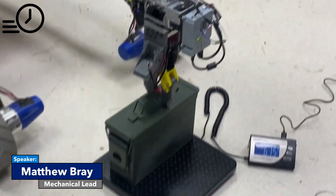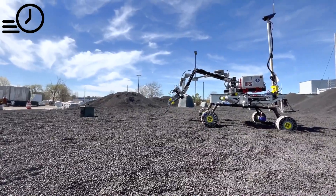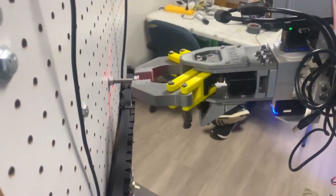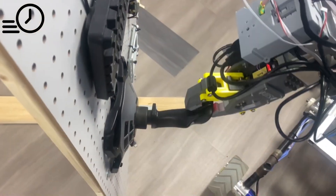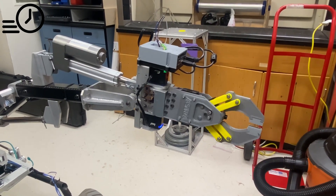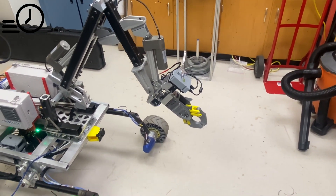The ARM module consists of the 6 degrees of freedom arm, housing for electronics, and an independent power supply. Its assembly is composed from carbon fiber composites to titanium metals, providing a lightweight but strong structure that supports lifting and dragging of loads greater than 5 kg. Movement is managed by three linear actuators which control the extension of the arm, and three servo motors that rotate the end effector using a bevel gear system. This configuration allows the arm to reach a distance of 1.9 meters and grasp objects up to 5.4 centimeters wide. A TPU grip surface on the end effector allows us to securely grasp objects critical for equipment servicing tasks.